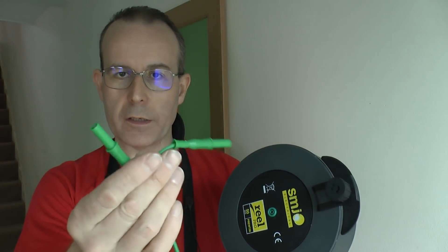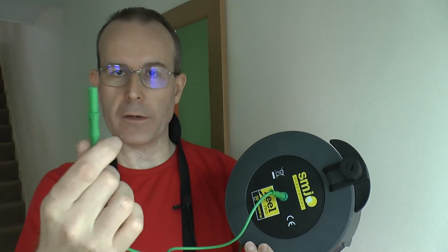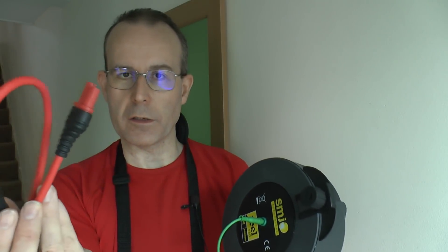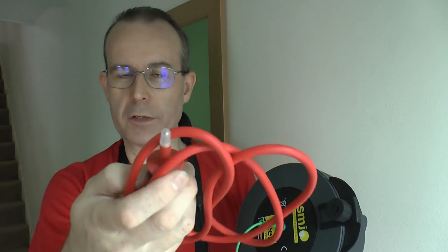It's important to disconnect the earth electrode wire from the main earth terminal, because if you just measure directly you're going to have other paths to earth via the main bonding, such as gas, water and similar things. So you do need to disconnect it because we're interested in testing the electrode on its own, not when it's connected to all kinds of other stuff in the installation. Now we're going to need two test leads for this — one with a plug on each end that goes into our testing instrument, and another which also goes into the test instrument and has a small point on the end, plus a test button on the side so we don't have to have six hands to work all this at the same time.